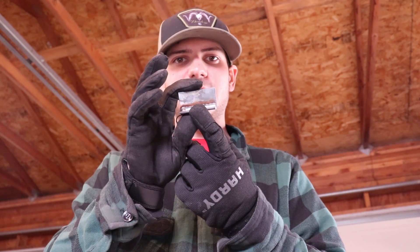Alright guys, that's the quick video on cutting and etching the MIG-like-TIG versus regular MIG. Hopefully you learned something. Make sure that if you're using a technique, it's for what you're building. If you're building stuff that doesn't matter — not strength-critical — you can use MIG-like-TIG. But if you're doing something structural, you really want to use the regular recommended MIG settings to get a good sturdy bead in there. If you like this video, give me a thumbs up and subscribe. Hit that bell so you get notified whenever I upload. Check out my other videos and come follow me on Instagram at 5thStreetFab. Alright guys, have a good one.